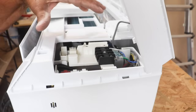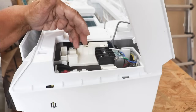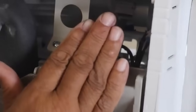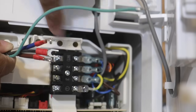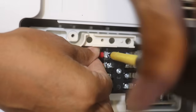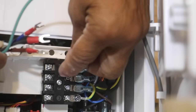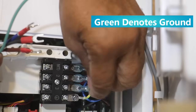The evaporator has to communicate with the outdoor unit — the condenser or compressor. Coming around to the backside of the unit, I want to show you exactly where to fish the signal cable through. Go to the top of the unit where my hand is and take the cable right through here. When connecting wires to the terminal block, match the corresponding colors: the brown wire connects to terminal number three, then black, then blue. The ground wire — yellow and green — goes on the ground terminal.